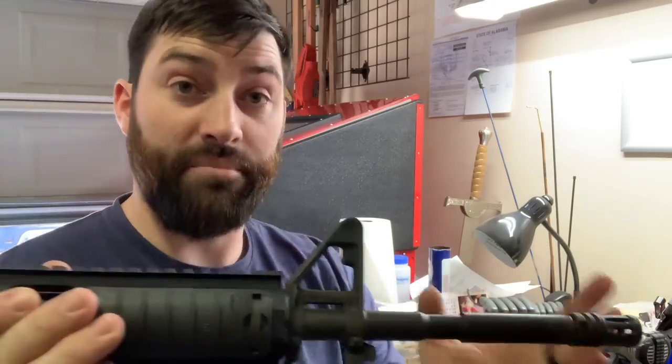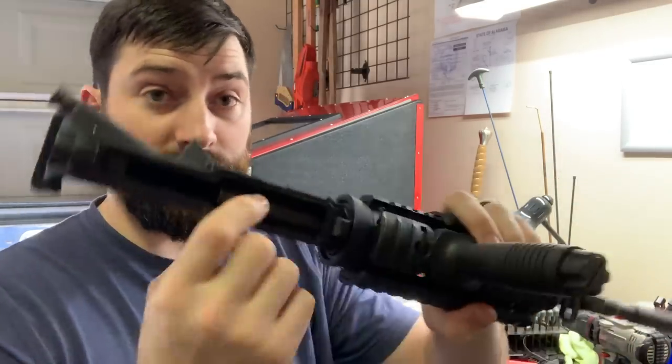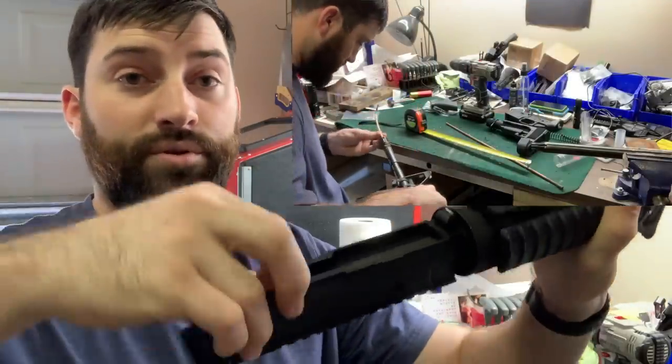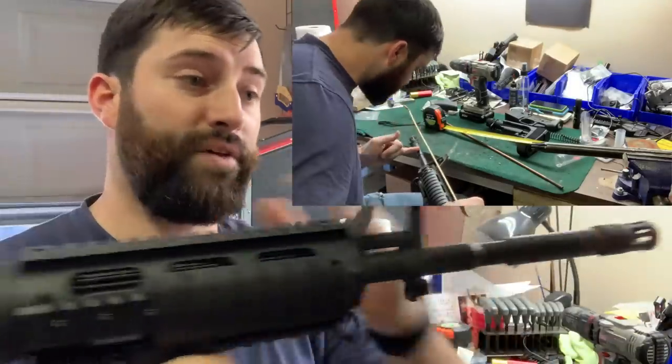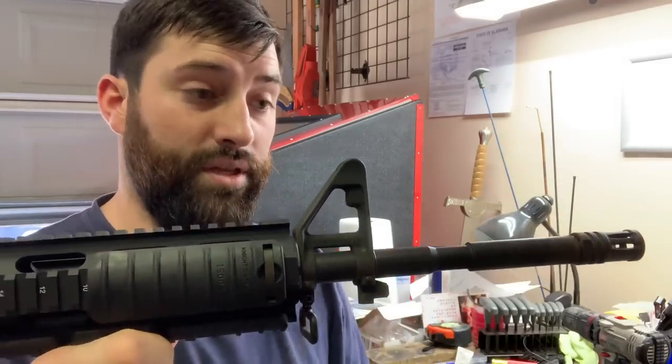When we back up, first you gotta measure the barrel, okay? To do that, you stick a dowel or something down the barrel with the bolt in it, right? Because you measure off the bolt face. Make sure that's pushed all the way forward. You don't want to get messed up with that being halfway in there. Make sure it's pushed all the way forward. Measure from the bolt face. Measure your length. Mark it wherever you need to mark it for the length that you want.